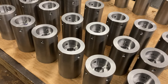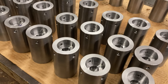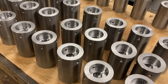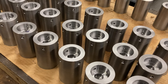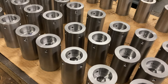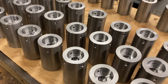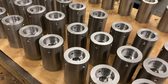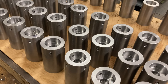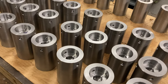So now I have to drill and tap four 5/16 holes on the outside periphery of the stock — the two and a half inch diameter material. I have some other features that have to be timed to those tapped holes, so I'm not tapping them yet — I'm just reaming them. Tap drill size for 5/16-18 is 257 — that's a letter F drill. I bought a reamer of 257 and a half, and I have some 257 drill blanks that I'm using to line these guys up, because the other features are 45 degrees off from the tapped holes.